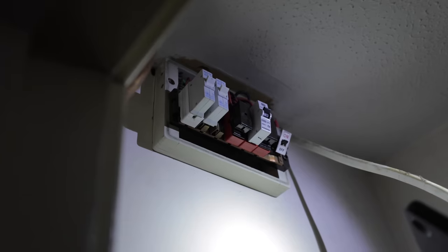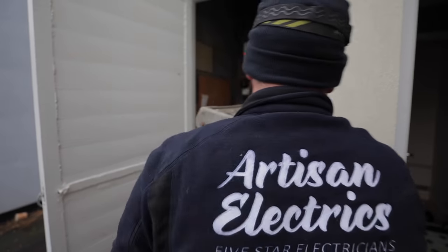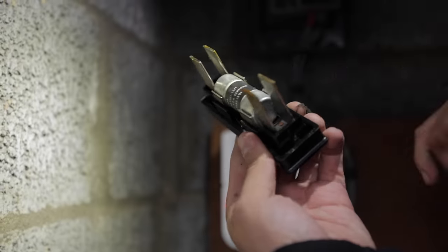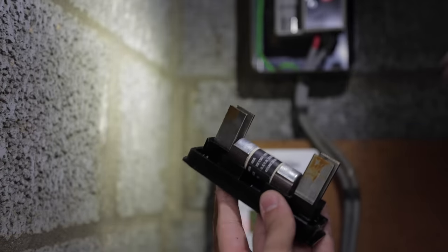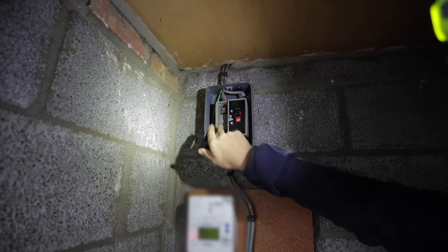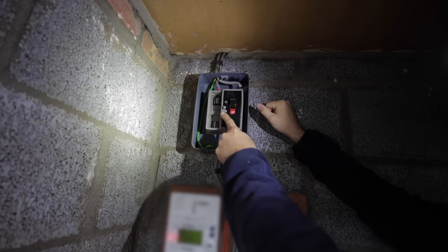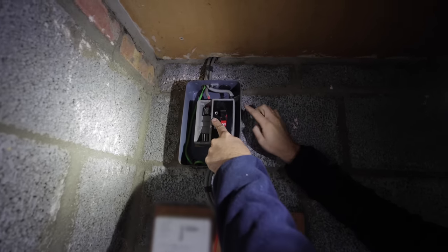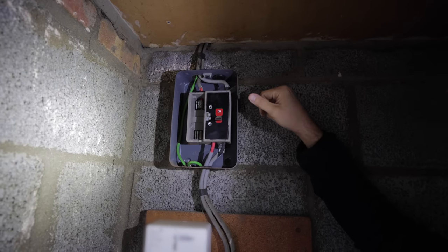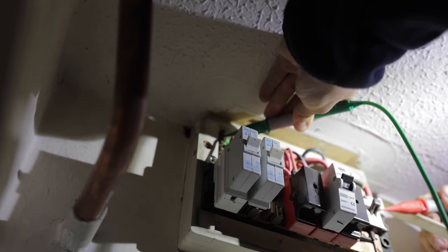We're just going to isolate the power and have a look at the switch-fuse outside. They've actually got a bit of grease on it - it's almost as if it's being maintained. They're supposed to grease the contact so it goes in and out nice and easy. This old switch-fuse has a safety device: I've got the fuse removed and it's off, so these are all dead. If I try to turn it on, it won't go on - there's a little lever here so when the cover goes on it pushes that in, which is a safety feature to actually prevent you turning it on with the cover off. It's only a little primitive thing but it's quite clever.